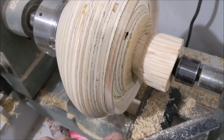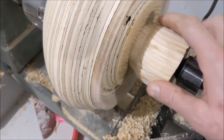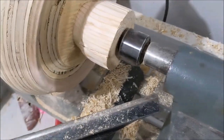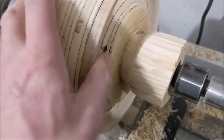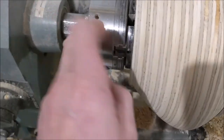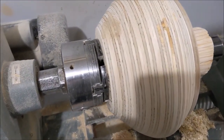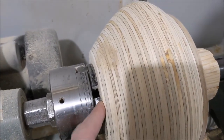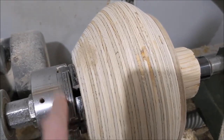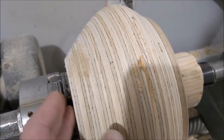Off camera, the bowl needed some more support. What I've done is cut a plug and turned it down on the lathe so it fits into that hole — I've got a hole in the top and the bottom — and I put it up against the live center, so that's going to support the bowl. That gives additional support to the chuck at the back. You may notice that the bottom — I ended up cutting the bottom off. There was a crack in it, and when I was tightening this up it wasn't very secure. So I cut the bottom off and went back to supporting the bowl inside the hole I drilled through. That gives me the best support until I get it turned, and then I'll glue a new bottom on.